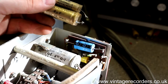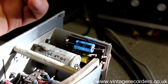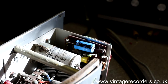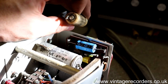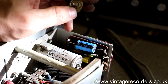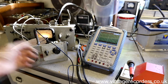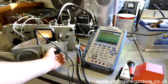I mentioned the words electrolytic and non-electrolytic. The difference is: non-electrolytics, although they may have a colour code either side of red and black, have no polarity. What they do have is a black end and a red end — the black end is connected to the shell of the capacitor and the red end isn't. On an electrolytic, which has different-style tags — usually bonded or riveted on these old-style ones — you have a black side and a red side, and the red side is positive. And this one looks quite mucky; it looks like it may have leaked. But we can see from the scope that we have an oscillator working — needs a bit of a clean, but it is working.